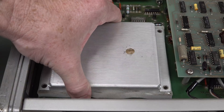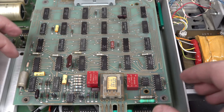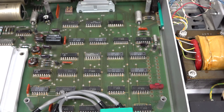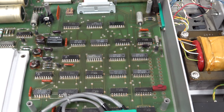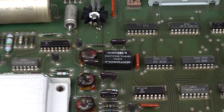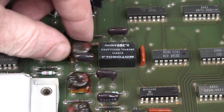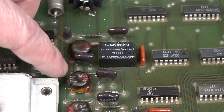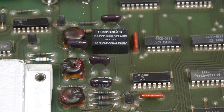There might be something on the bottom. That's for all you Japanese relay fanboys — Babcock. Let's have a look at what's under this board here. Ta-da! More stuff. Ha! Motorola Crystal Oscillator — upside down, so all the electrons are going to fall out. We've got some potted little custom transformers there, with like half a dozen turns on each side. And it's running at a massive 8.38 megahertz. Fantastic.